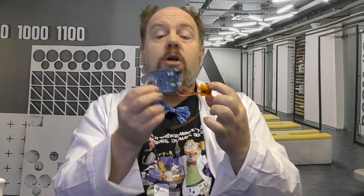But cut your sample time, or your pulse counting time, down to one tenth of a second. You'll still be able to see a difference of 800 pulses that you could count, so you could tell how much pressure you're putting on the fingertips. Your Arduino is actually controlling the servo's position, so you program the Arduino to change the position of the servo to apply more or less pressure as needed. The Arduino now has a method of sensing how much pressure is being applied to the object the gripper is grabbing. Don't be afraid to set your frequency very high — the more pulses per second you get, the higher the accuracy. There are limits of course, limits to how fast the Arduino can count, all while it's multitasking and driving the servo, or perhaps several servos.